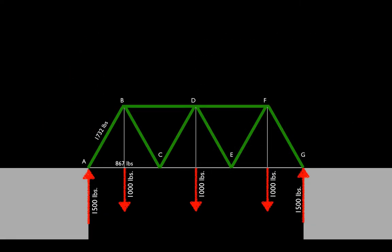We can come back to our truss and add those values: 1,732 pounds in AB and 867 pounds in AC. Next, we can walk over to node B. Knowing there's a 1,732-pound compressive force coming from AB, and that the hanger carries 1,000 pounds, we can figure out what combination of forces in BC and BD would be needed to keep node B in equilibrium.